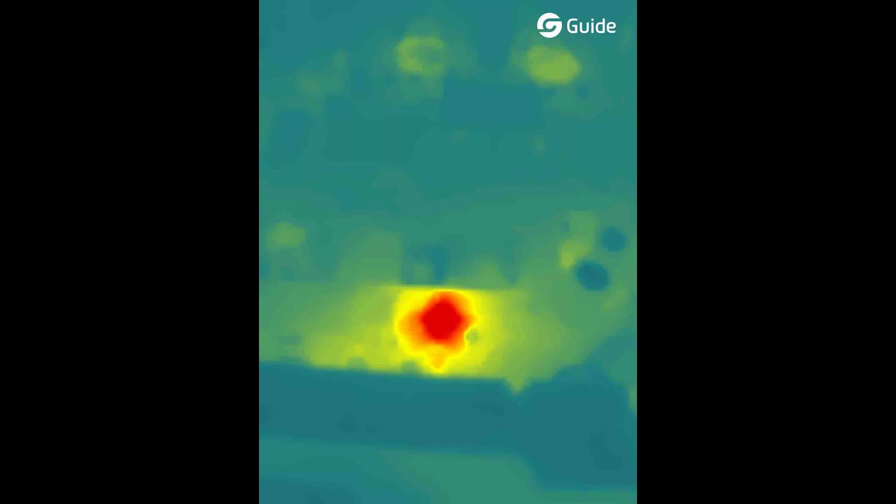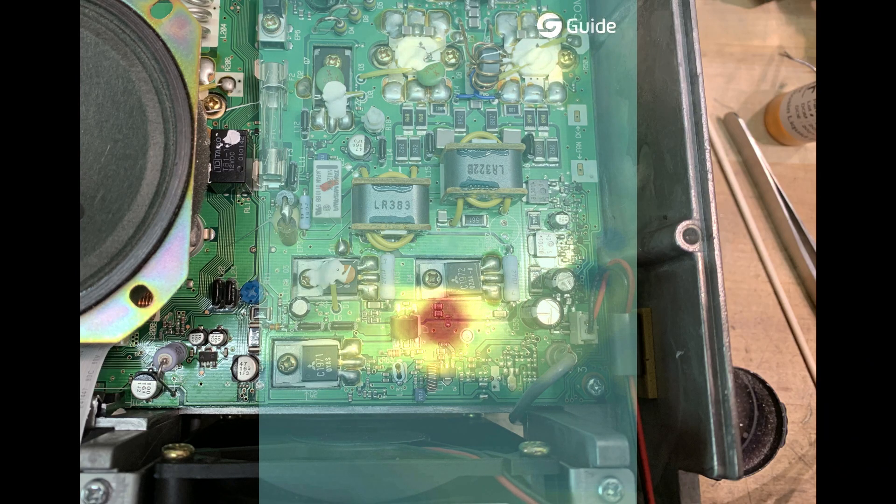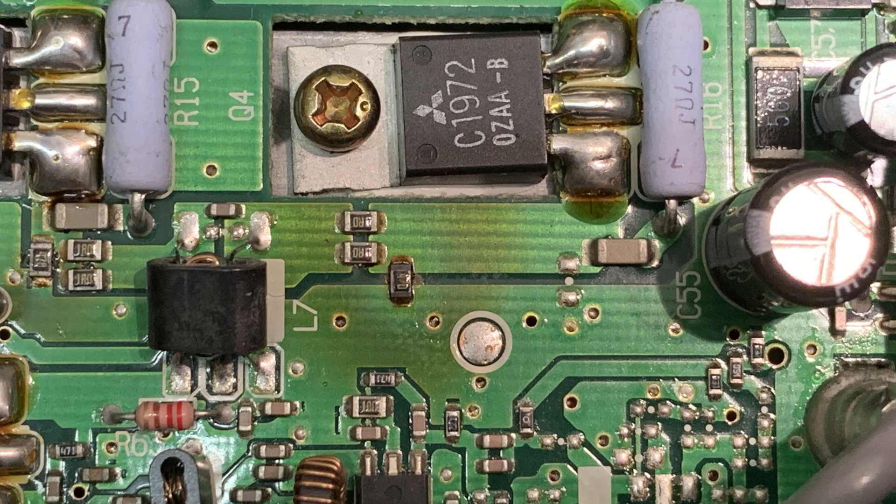So let me try to superimpose these two, and you can see how the little spots at the top there overlap. And then at the bottom, the hot spot is coming from a very bizarre location. And unfortunately, that location goes to one little 47 ohm resistor. And he's black. He's toasty. And he's discolored the board around him. If you look over to the left, it looks like there's some discoloring over that way as well. Things were getting warm in this area.